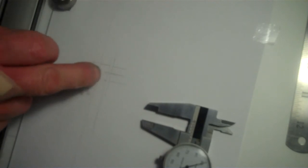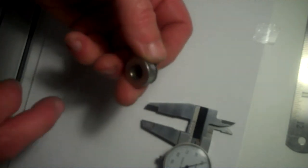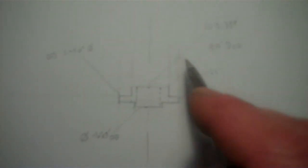Alright, I'm ready to start making this shaft fixture to fit this, and then to start making the actual flange bushing next. So what I'll do now is I'll go ahead and make this shaft fixture first, and then I'll make the actual part next, and I'll bore that to fit. I'll make the shaft fixture to fit inside the internal bore of this right here.